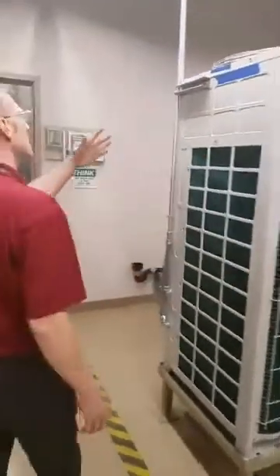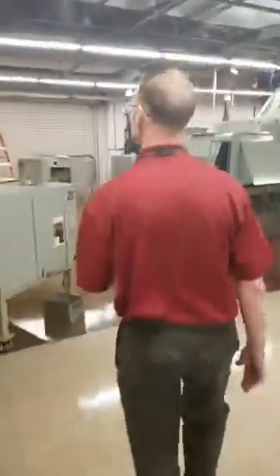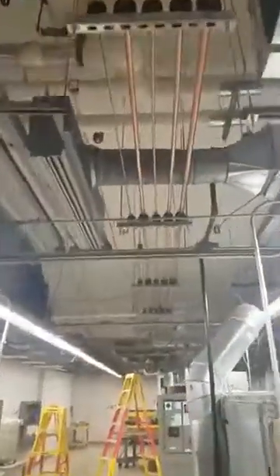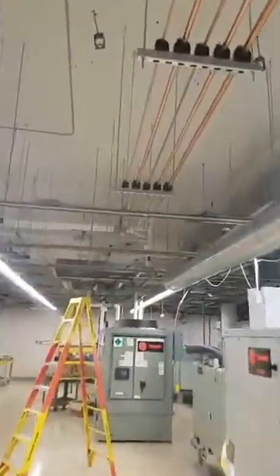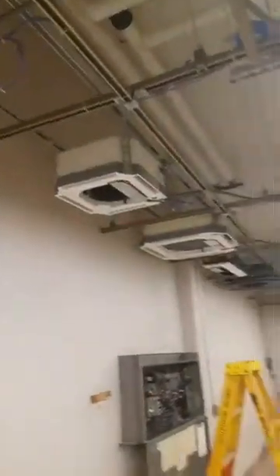We've got piping going on here — getting our main lines. Our installers are doing their nitrogen purge as per our installation requirements, and we follow that rack on down the way. We see more of our main line piping with a nice support for that piping in accordance with the installation requirements. We're still in the process, but we're going to be connected up to our mode change unit for our heat recovery system and also having piping run through our branch joints to our indoor units for our heat pump.